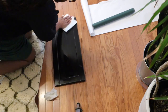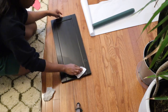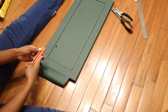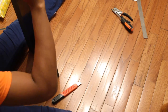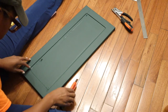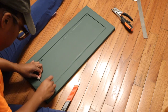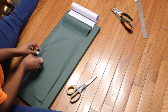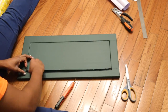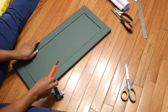There are a couple of ways you can put the paper on so I tried all of them. First you can do sections — the downside is that the middle part did start to lift because the edges were cut so short and they weren't tucked under anything. Using a blow dryer might have helped but I honestly didn't think that far ahead. Doing it in sections was probably the most time consuming of the three ways, but I also feel like this looks the best out of all of them. The contact paper comes in different lengths — for the darker green I bought one 17.7 inch by 78.7 inch and a 17.7 inch by 118 inches, and with the amount of times that I messed things up, these were just enough.